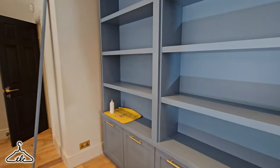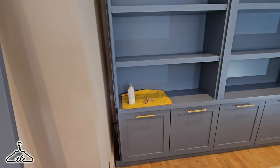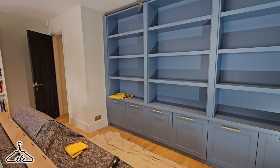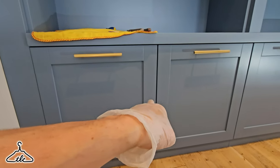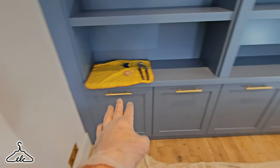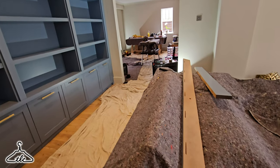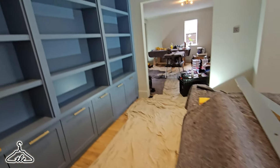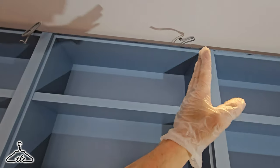I am super happy with the way these are coming out so far — absolutely lovely, if I can say so myself. All that's left to do is the top trim and the side trim, and I'm going to glue that in the same as the last one. That trim is in now. I need to adjust this door to the right — I've got quite big gaps across, like three and a half to four millimetres, so I'm going to move those over to hopefully get them around two and a half to three mil each. The uprights are in, it's just a matter of getting this top trim in. It's in two pieces — we've got holes drilled and two library lights coming around this point so the cable needs to be pulled through. The joint stops there because most of the light fitting is going to cover that joint.